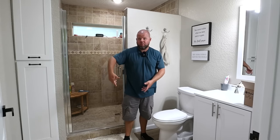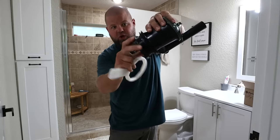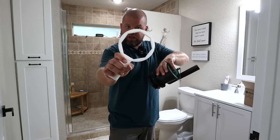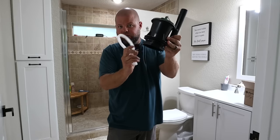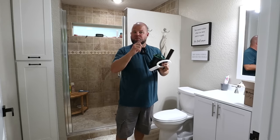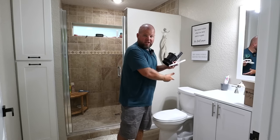Don't forget the tank still has water in it — be nice and level. Go to a shower or tub and dump that remaining water out. It will not go down into the flush valve assembly as long as you remain level. After you remove the tank, your valve assembly is going through the tank, and there's a large nut on the bottom side of that tank. Luckily this kit comes with a spare wrench in case you threw your old one away. You remove one nut, replace your entire valve assembly, put it back in, and slide the tank back down after you verify that the gasket on the bottom side of the tank is nice and in good shape.